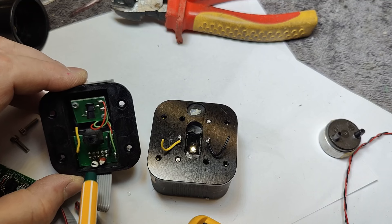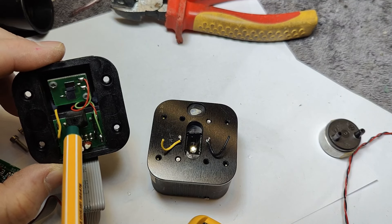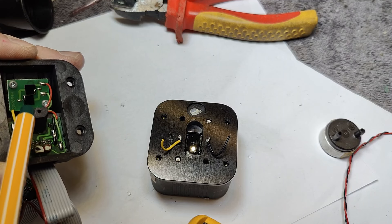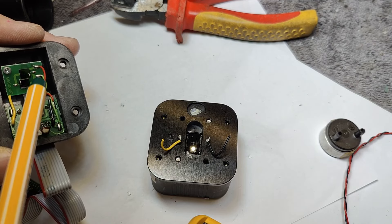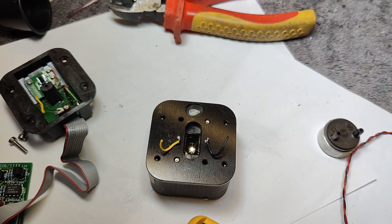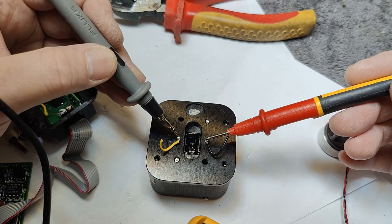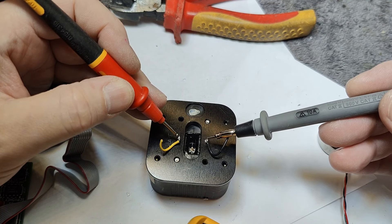I investigated a little bit more down this hole, and you can actually see it now. There's a little infrared LED down there that shines light to that mirror. When the mirror moves, it shines light back to those two detectors, which are in opposite directions. You get a positive and a negative signal from this little solar panel depending on where the light hits. So this is a strong magnetic field, and I have my little diode tester. If I put a little current here, let's see what happens to the mirror — it moves! And if I swap the polarization, it moves the other way.